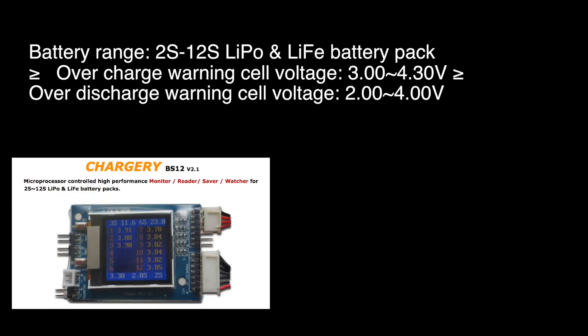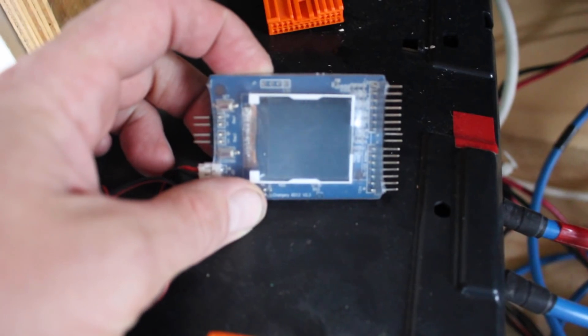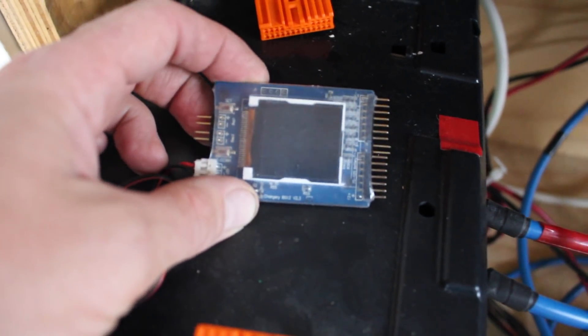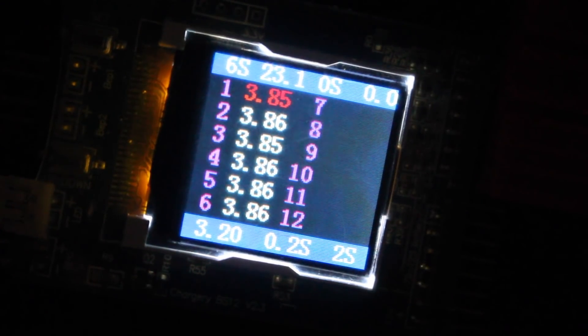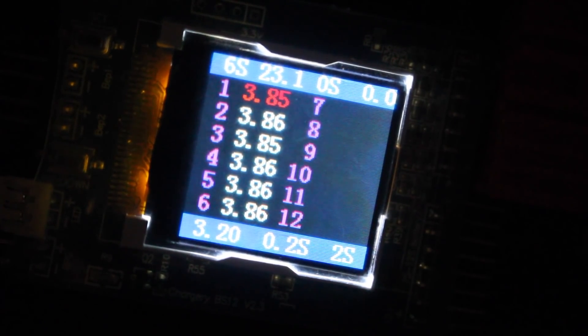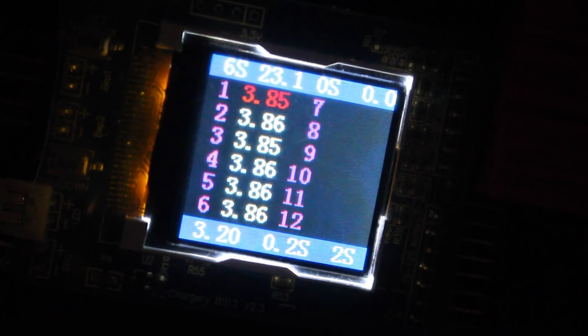So far we've found our volt battery to be very stable. I don't have a full-time monitoring system, but what I do have is this unit which allows me to check the state of charge of each individual cell whenever I'm up at the cabin. I find it's best to check the system at night time when there's no incoming power and preferably no load, so you can get a stable reading of the voltage of each individual cell.